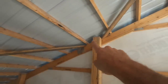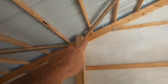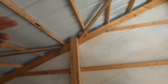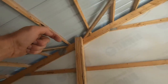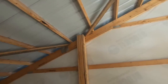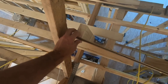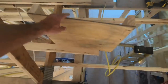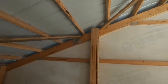One thing that I will do, since there is no roof sheathing on this, I will build — I'll take a 2x4, probably like an 18-inch 2x4, and run a piece of plywood across it. So when I drill my hole and I run my screws through my flashing, it'll have something solid to hit. These were 2x4s — I ripped them down half-inch so that these will fit up there, and then just put a piece of plywood in there, and then my hole will go through the middle. It's going to slide right up in there, and then I'll screw it into the purlin.